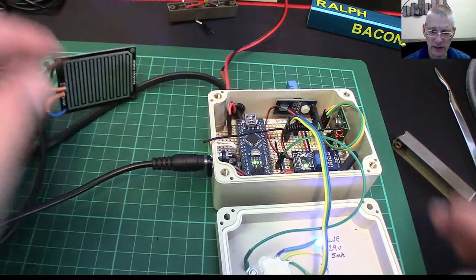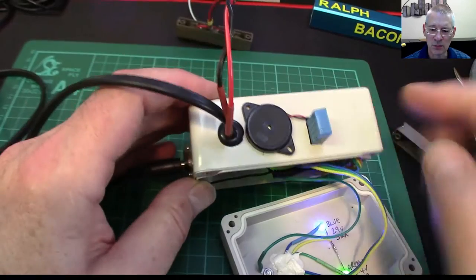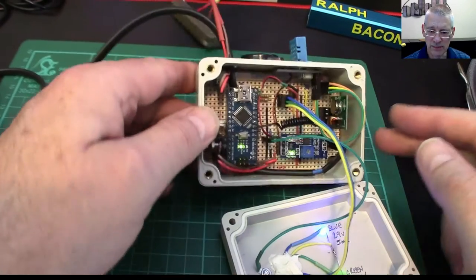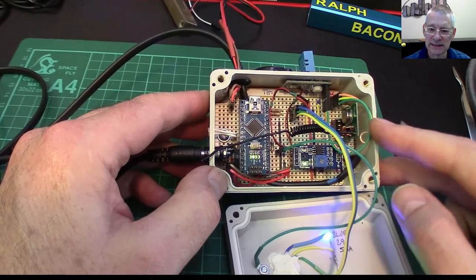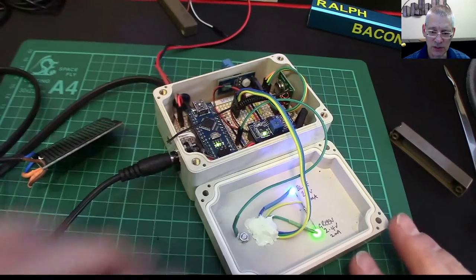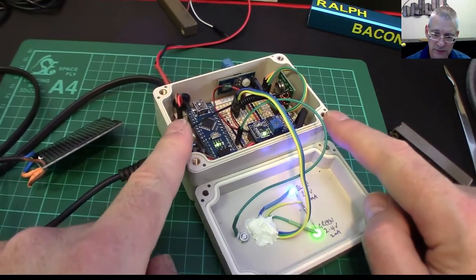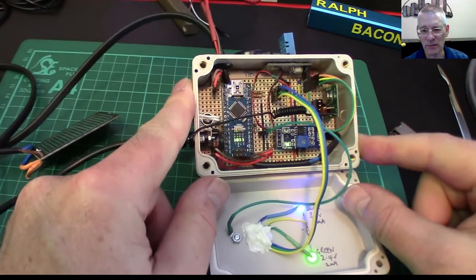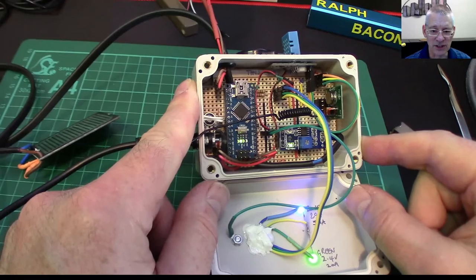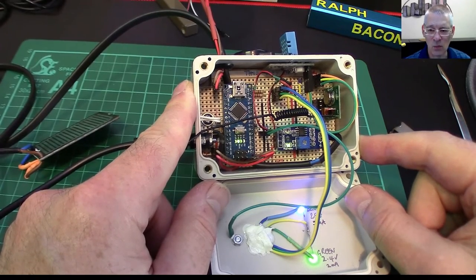This rain sensor pad — I'm hoping it'll survive the test of time. I've soldered on the wires and put some heat-shrink tubing on to protect the joints. The capillary action of rain will probably work its way up there, so I'm going to install it at 45 degrees so that water will run off. I've fed these wires through the mounting holes at the top just to give a bit of strain relief, and I'll be screwing it onto a little board through the bottom. This is going to be on top of the roof to sense the rain. There are holes for power, the sensor, and the touchpad/door sensor — I don't think I'll seal any of those.